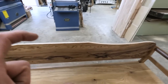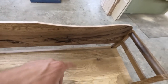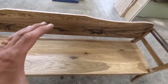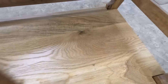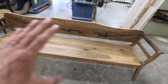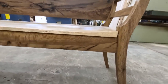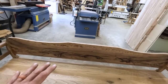The next thing we did is turned our attention to the bench seat. We ended up putting a wooden seat on this one — generally these will have a cushion. This is regular white oak, and we carved this out on the CNC so it has a slight shape to it, just to give it a little more comfort and a better look. A flat plank of wood just kind of looks silly. If you look at it from the profile you can kind of see that shape coming up right there. The CNC took care of all that, and then quite a bit of sanding to get it all cleaned up.